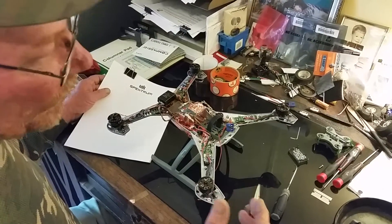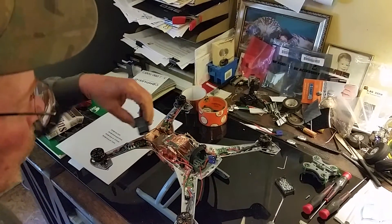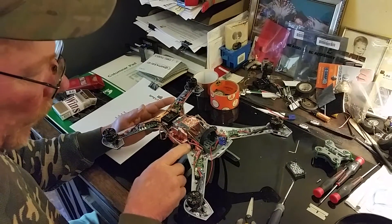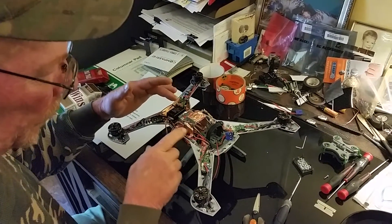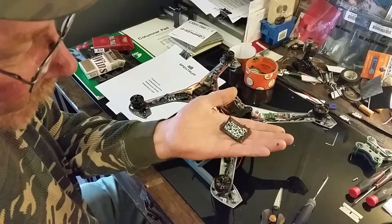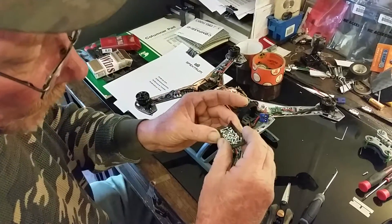He wanted to see if I could get it to work, and of course I took off on that journey. You'll need the TM1000 telemetry module and the GPS sensor that ties into it. Mine is a V2 firmware with ferrite rings on the ESC wires, which didn't leave a lot of room. Being innovative, I took the module out of its plastic box - the case makes a nice little screw holder now. I stripped the module out of the box.